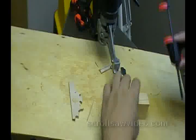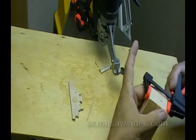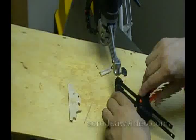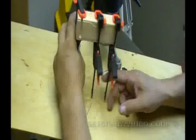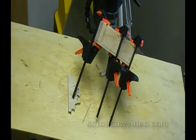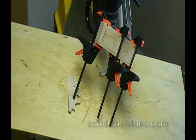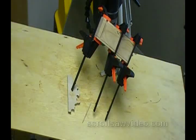During the glue process I'm going to go ahead and set this in here, slide the top on, and take my bar clamps. This is where you'll need to make sure that your bottom lines up with your top correctly, so properly line up as you're putting the clamps on. I'm going to let this dry for a while, then come back and do a little bit of detail sanding. If it isn't perfectly matched up, that's fine — I'm going to sand it down to where it's smooth and round over the edges with sandpaper. I'll let this dry for about 30 to 45 minutes and come back.